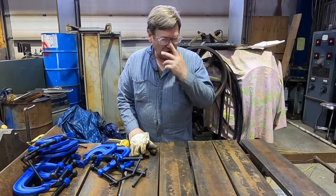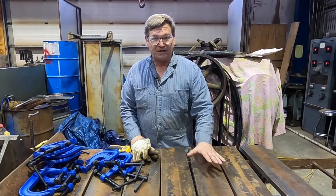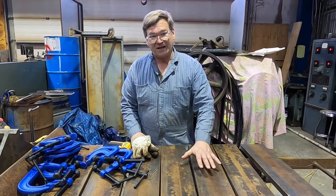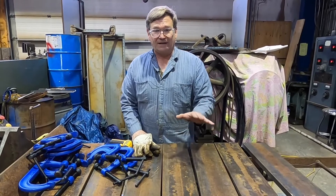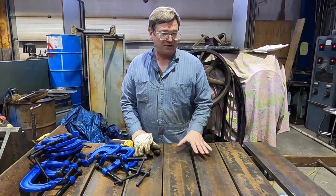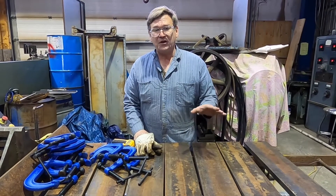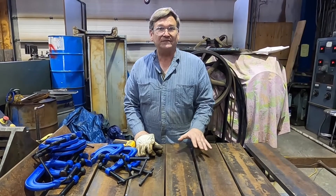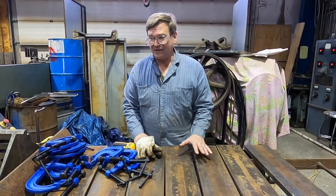I saw two people on various forums about heat treating on the internet suggest leaving it in the bag, and it was something I thought you might be able to do. I hadn't seen people actually do it on a video, so that's where we did it. I had previously tested it, and at 1800 degrees, our test pieces after tempering came up at 62 Rockwell C. So they got good and hard, and we'll give the results on these after we test them.